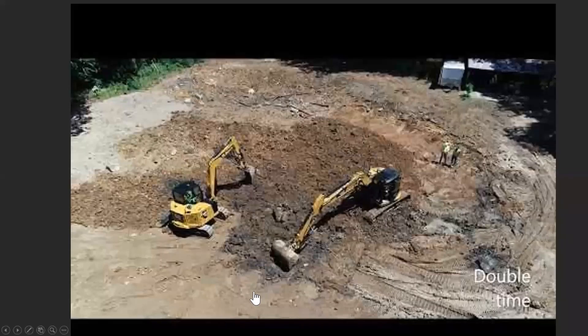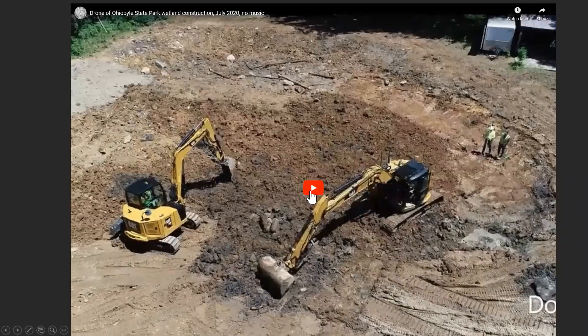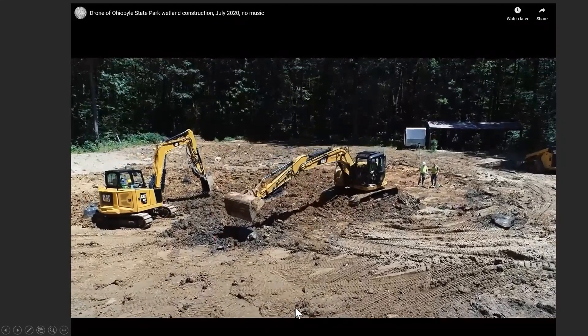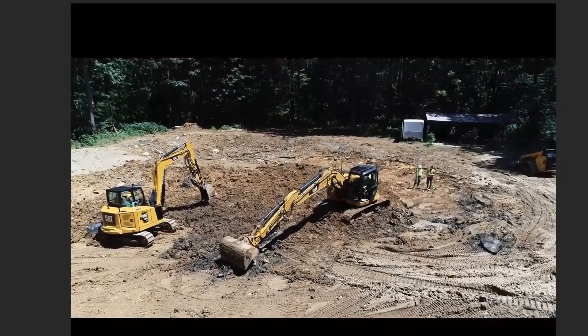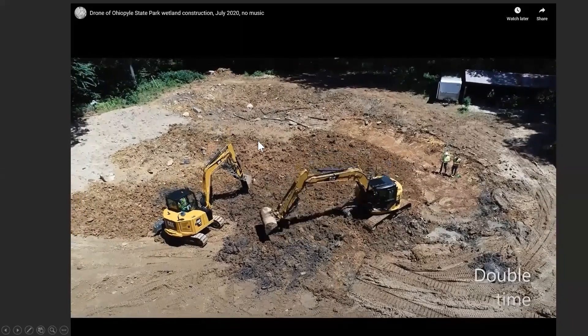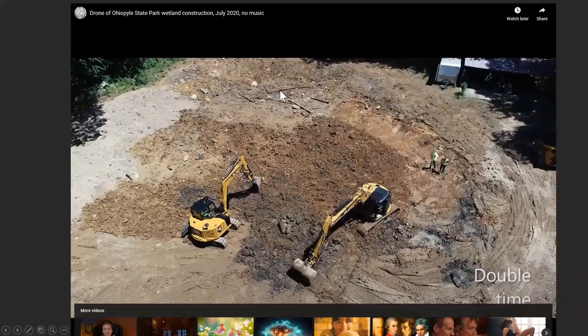Here's drone video providing a big picture of the project. The excavators are using the rough and loosened technique to break up the compacted soils in the wet meadow, leaving pits, mounds, and small pocket pools. You can see the vernal pool in the center left. The area snakes around and empties out into the wetland. Off to the left is where we replaced the sand for the nesting area for turtles and insects — we moved that to the opposite side of the pool from where it was originally located so it would be less likely to be disturbed by access roads and general traffic.